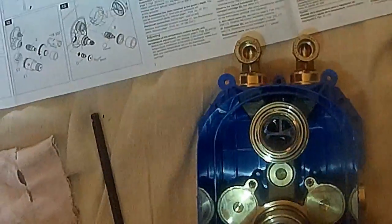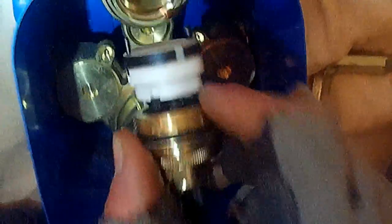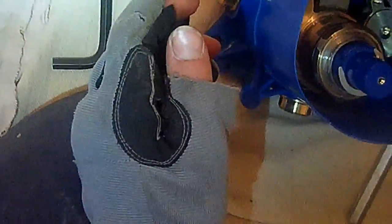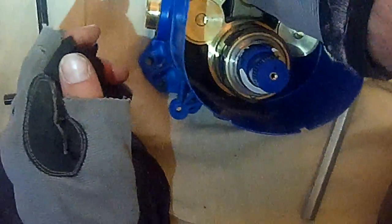You see that turns — so this can turn independently of this brass body, which means it's fine. We're not going to have any shearing factors going on once we line the pins up correctly. So the little one on the left, big one on the right — in we go. It's a bit unnerving because you can't see it, however I have full confidence that it's fine. I'll do this up hand tight — one, two, three — which isn't very tight. Fingertips covered in grease. We'll get our spanner.